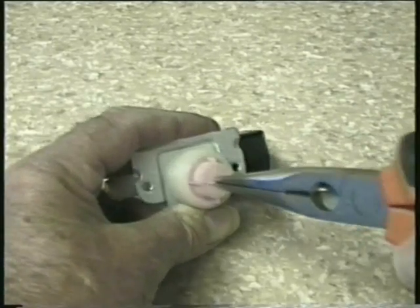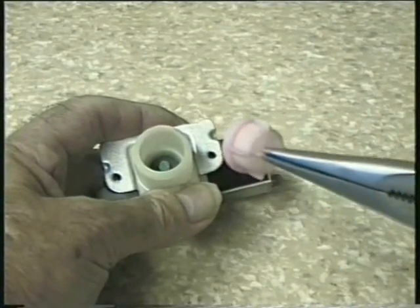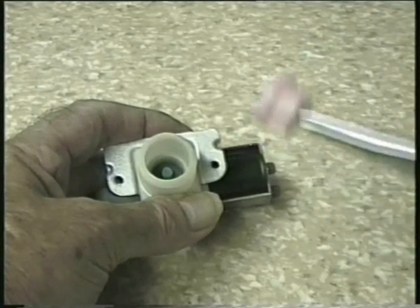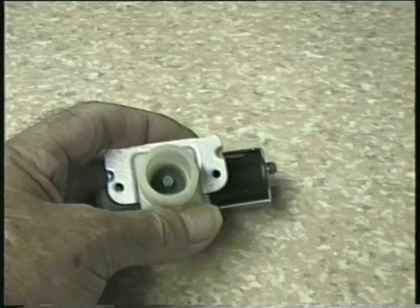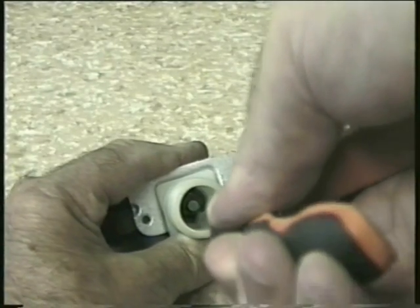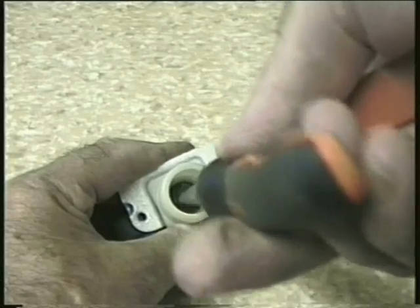When you remove the filter, grip the tab on top of it with a pair of long nose pliers and pull it all the way out in one movement. This will prevent any small particles of grit falling back into the body of the valve. The flow restrictor can be removed by gripping it at the side and pulling it free — it sits on a small moulding in the centre of the valve.